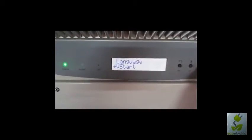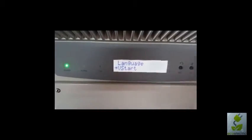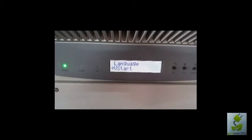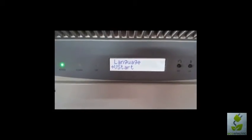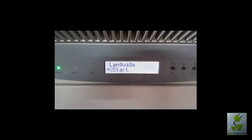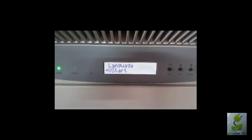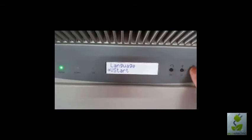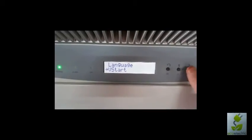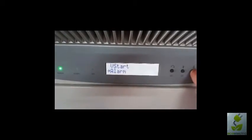We use this start voltage setting to wind down the inverter to make it start on a lower voltage. You won't get more power out of doing this — in fact, you will make the inverter run in a less efficient manner. So that's an installer-only menu that is used to get around some tricky design configurations. Generally we design your system so that V start does not have to be used.